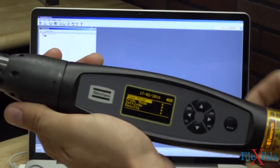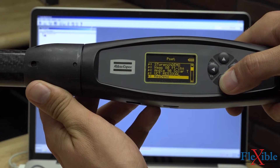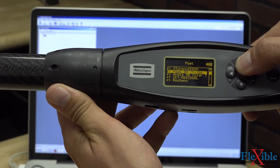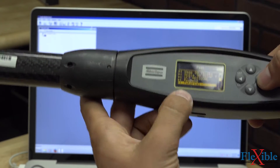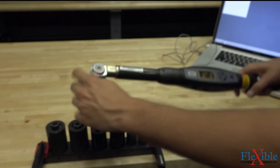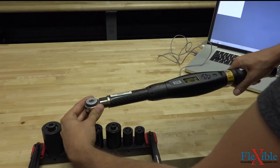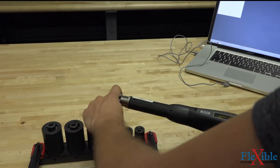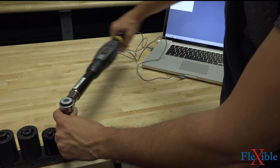Close this out and disconnect. Now back on our ST wrench, go ahead underneath program mode, PSET, and we see that our residual torque PSET is now right there where we wanted it. Let's go ahead and use the tutorial PSET that we created in the last video, because I know this is going to be tightening these bolts down to 25 Nm almost exactly. So I'll go ahead and launch it. I'll loosen these two fasteners down, and now I'll switch it back to tightening. Using the PSET we should be alerted exactly when we hit our torque at 25 Nm.